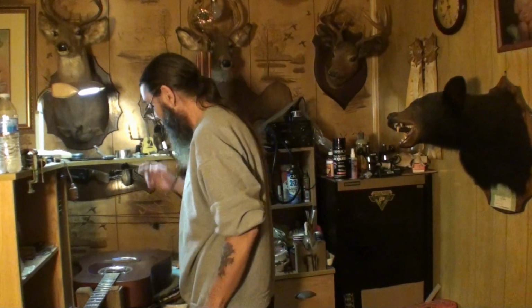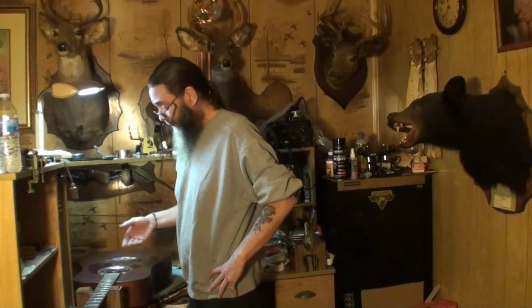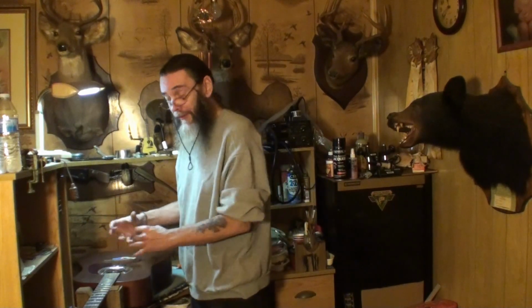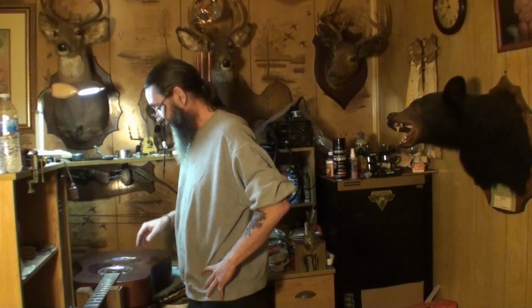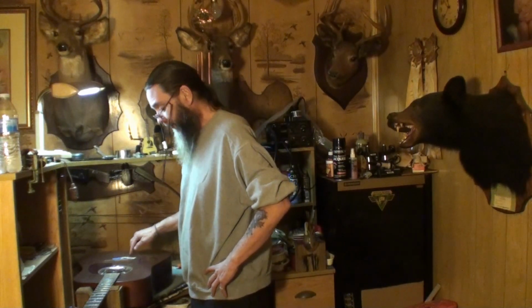That's very important. If you just stick a humidity gauge in there and leave it for 3 or 4 hours, you're going to get a reading, but you're not going to get the humidity content of the wood. You're getting the humidity content of the inside of the guitar. So I'm going to leave that in there until tomorrow, 24 hours at least. Really need to leave it in there longer than that to get a true moisture content of the wood. That's how much moisture is inside of the wood right now. But I'll fill you in on that on the next video before we start on the frets.